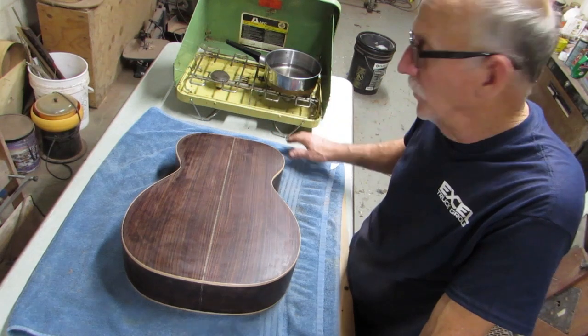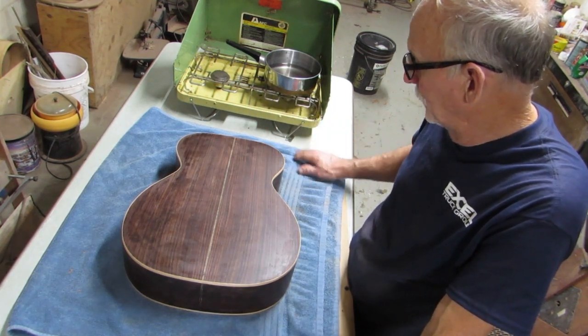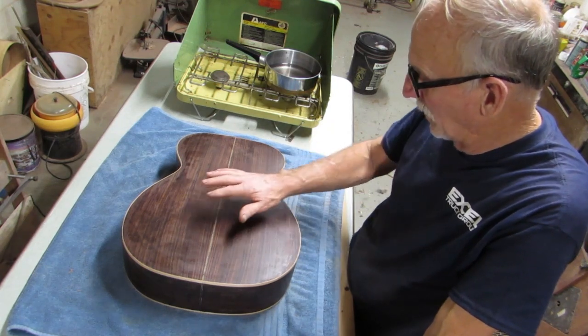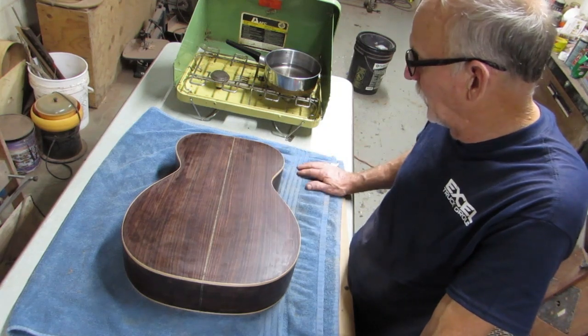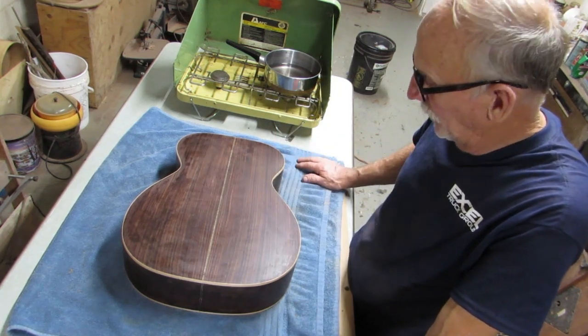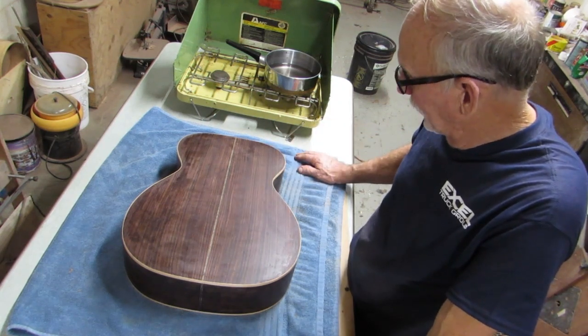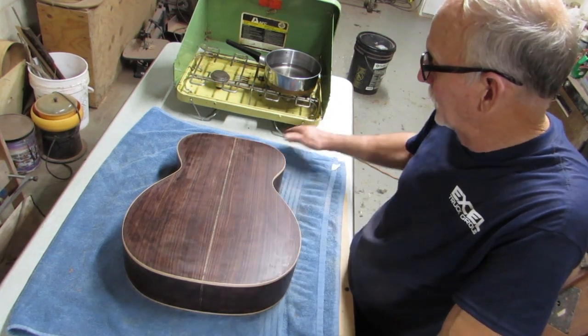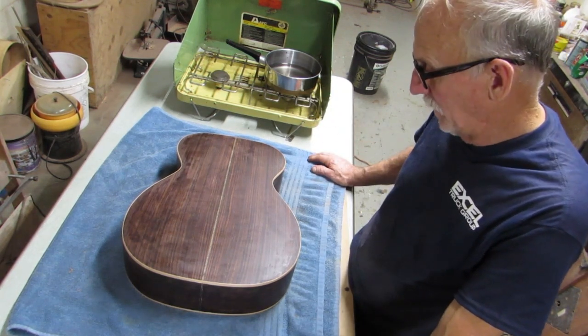I have my second coat on. I used a rag to apply several thin coats. It's pretty much dry, but I'm not going to sand it right now. I'm going to wait and let it dry 24 hours to allow for shrinkage of the glue. I used a razor blade to knock down some high spots. So tomorrow I'll sand it down, and we'll see what we have.